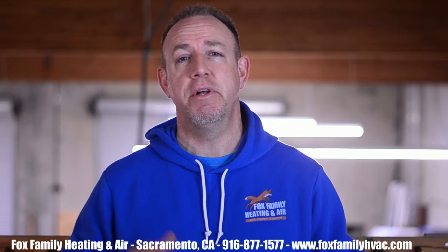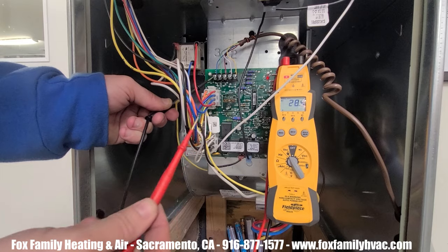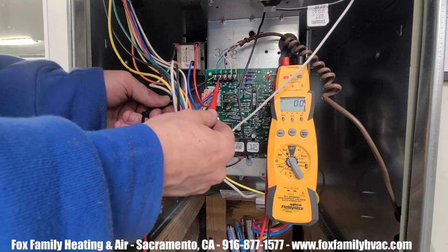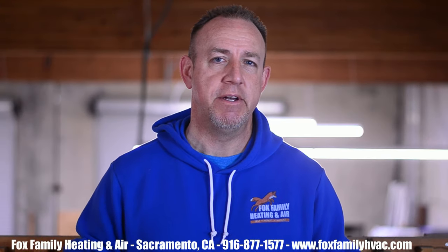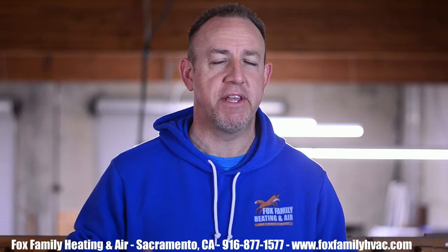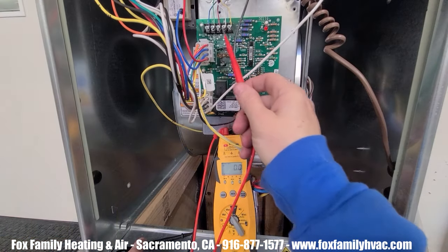Now, in the heating mode, the 24 volts at the R terminal connects only to the W terminal to start the sequence of events that happens for the furnace to start up. It energizes the W terminal, but not the G terminal in the heating mode because the control board tells the blower when to turn on. That's usually 30 to 60 seconds after the flame has ignited to start heating the furnace up. The delay in the starting of it is because we don't want cold air coming through our ducts while we wait for the heat exchanger to warm up. Smart, huh?